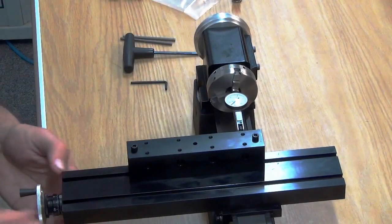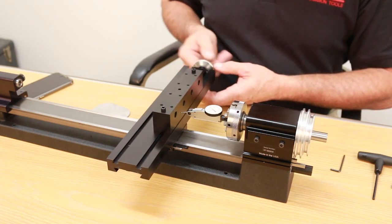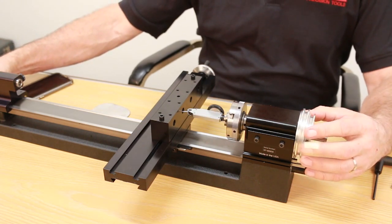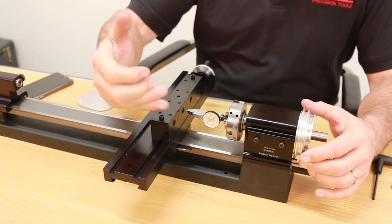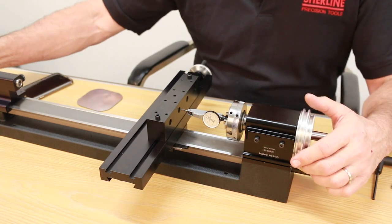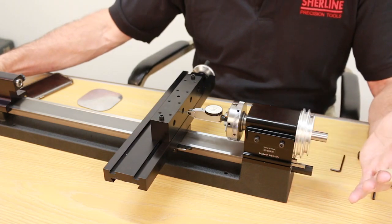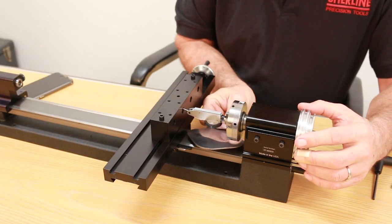I'm going to move it out of the way, zero my hand wheel out, and move over an inch and a half. Bring it into the next hole. I've got ten on this side and ten on that side. So the spacing between holes is an inch and a half — once you find the first one it's inch and a half increments for the next two. Right now on these holes going in here, that guy's measuring about one and a half thousandths above — it's measuring seven and a half, and this guy right here is measuring eleven and a half.